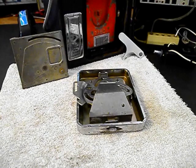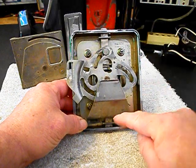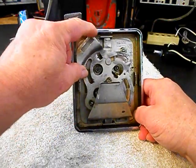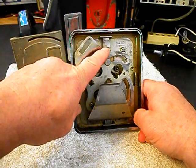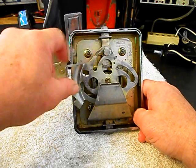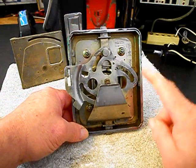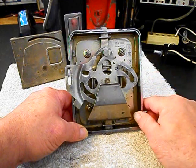And so basically what's happened is someone in the past ground down all of the deadbolts in the locking mechanism for the T-key. And once they were ground down, if you moved the locking mechanism in that direction, all of the deadbolts would fall behind their guides, and then nothing would move. It would just lock up. So that's why Scott didn't have any luck trying to use a T-key. So basically, they ground down the deadbolts so far on the sides that we just went ahead and removed them.